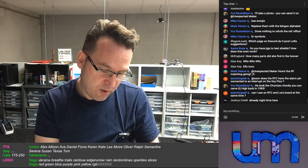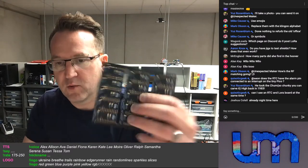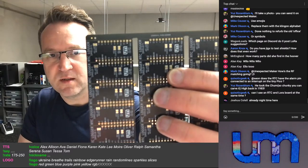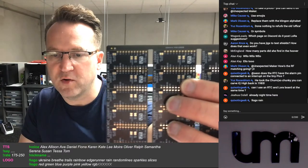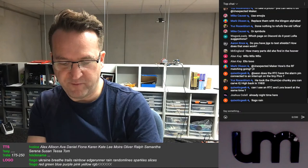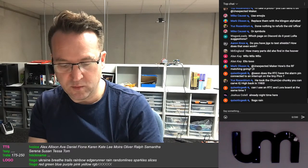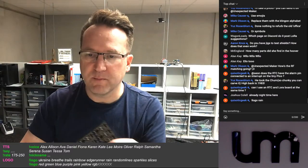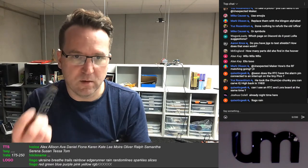Oh no, the jumper is for the interrupt. There's a jumper for the interrupt on the back. So, it's bridged, but you can cut the trace if you want to free up the interrupt if you're not using it. And there's also a jumper for the clock, which by default is not connected. So you need to bridge that if you want to use the clock pin. Otherwise it frees up the I/O. So, yep.